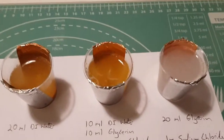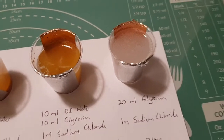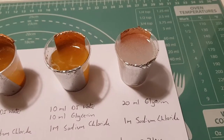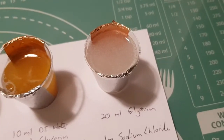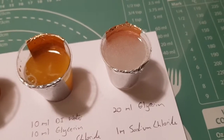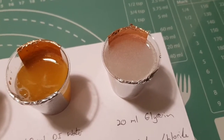Last place is the pure glycerine cell — the performance is really bad, and that's not totally unexpected given its thick consistency and problems with ion mobility. I also tried magnesium chloride as a salt because sea salt was really bad at dissolving in glycerine, and magnesium chloride actually dissolves quite well. I started with about 1.9 grams for the 20ml, tried charging it, but couldn't get any power out of it at all. I then added a lot more — probably five or six grams — until it was pretty saturated, but still no output. So that one's pretty much dead.